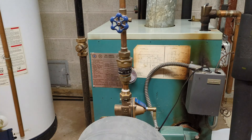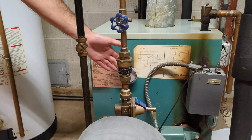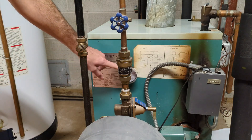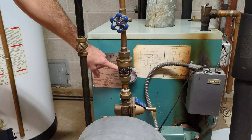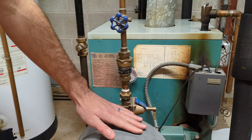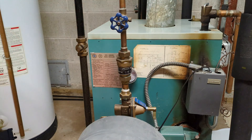There is a chance you can get multiple failures within the system — between the pressure relief valve, your gauge, and the expansion tank. If your gauge is broken and not reading the correct pressure, you might think everything's fine. But if you have a broken expansion tank and your pressure is consistently going over pressure, you're going to be leaking through the pressure relief valve.